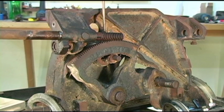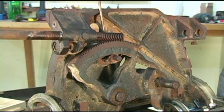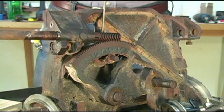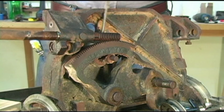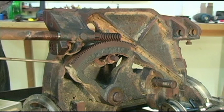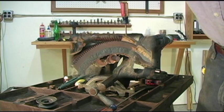I want to see. Oh, wow. I've got this thing out about a 32nd of an inch. It's maybe exactly the right way to go here. Now, one of the things I've got to be sure of when I get ready to put this saw back together is that if I put any indentations in either one of the surfaces where this meets with this, I need to get those filed out, or I'm going to start having problems. Now, if I come over to this side,